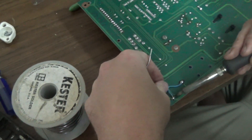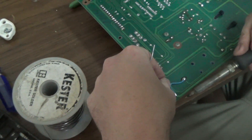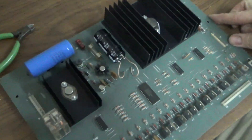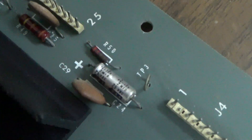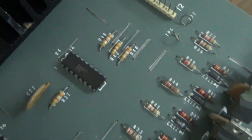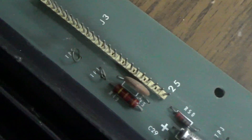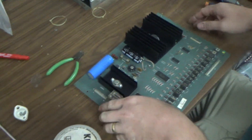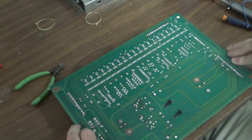We've got one more. Up on the top, the 12-volt comes in at test point 5. The 5-volt is there at test point 1. It runs off the board and through a jumper to get down here to test point 3 to power all of these chips with the 5-volt. If either one of those pins is a mess, you get problems with solenoids locking on. So what we do is tie test point 1 to test point 3 — you're just making the jumper on the board rather than on the connector. Turn it back over and put a jumper on test point 1 to test point 3 there below it.